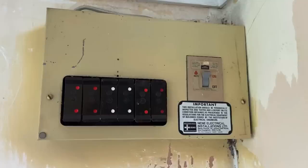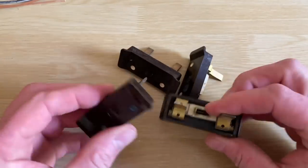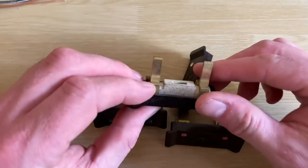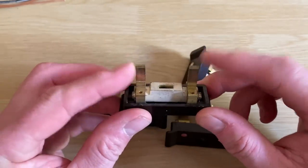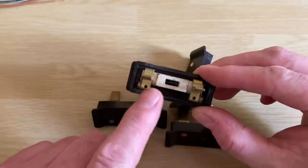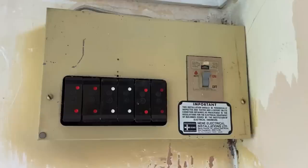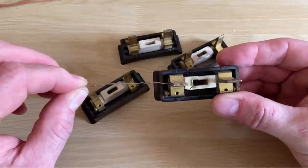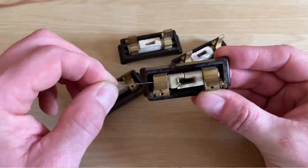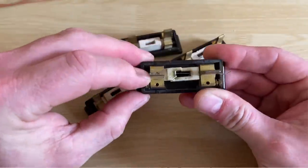If it was at nighttime, we would be plunged into darkness, and you'd have to return to the consumer unit to re-energize all the circuits - quite inconvenient and dangerous. The overcurrent protection devices are BS3036 semi-enclosed rewireable fuses. Inside there are a couple of attaching pins and a piece of thin copper wire between them. When there's an overcurrent or short circuit, the copper itself will melt and disconnect the circuit. We know they're not very precise devices - they have a fusing factor of two, which gives us some concerns when doing our design. And when they do operate, it requires skill to re-thread another piece of copper wire through between the two terminals to re-energize the circuit.